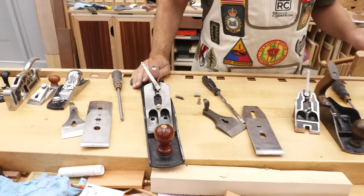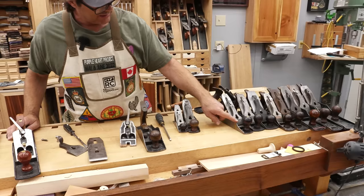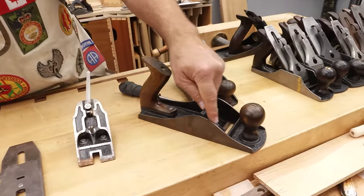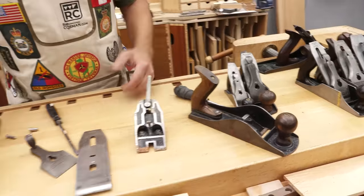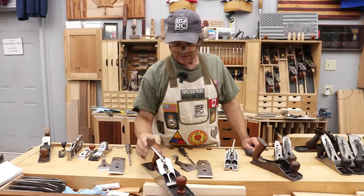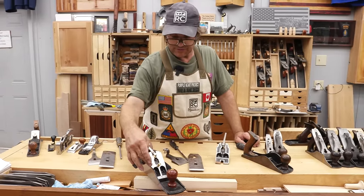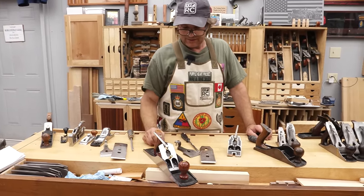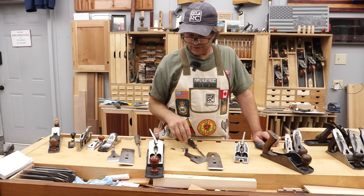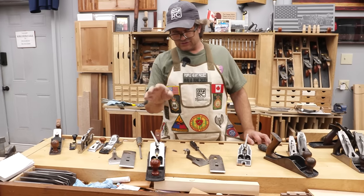Now, if you're looking for an old one, the old ones typically, although not in the beginning, but for the most part, were flat across the top of the shoulder, whereas the normal bench plane has that rounded shoulder. So if you're trying to spot an old one in the wild, that's how you'll find it most easily. However, the newer companies that are making the same plane have followed the same situation and they've flattened off the top. But better machining, far better support of the frog, and the flexibility of being able to open and close that with ease makes the bedrock the plane of choice.